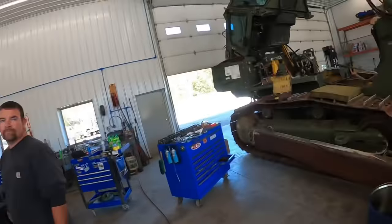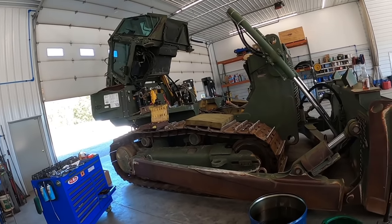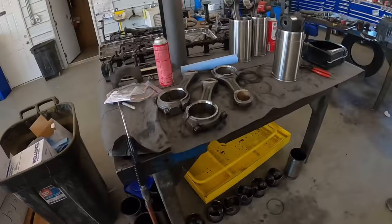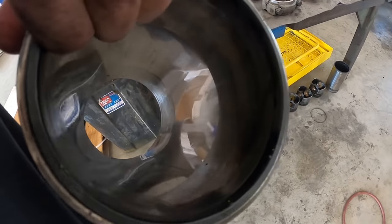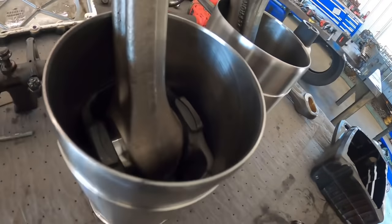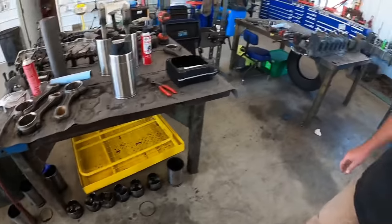The reason was it had a bunch of blow-by, you'll see in the first video. They didn't have an air filter in it and the intake boot was off of it. So we showed you in the first video, here's the old piston liners. You can see down it's all shiny. It shouldn't be that way. It should be all cross-hatched up and new like these new ones you see here. So you guys see that cross-hatch mark. But it ingested too much dust. It had a bunch of blow-by.